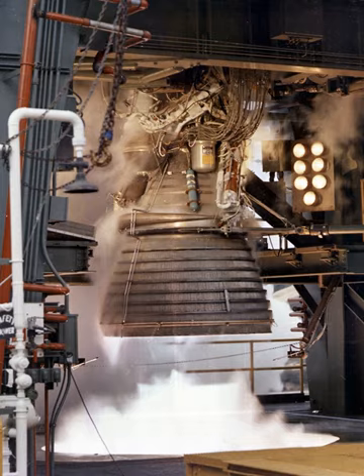The fuel turbopump, mounted on the thrust chamber, was a turbine-driven, axial flow pumping unit consisting of an inducer, a seven-stage rotor, and a stator assembly. It was a high-speed pump operating at 27,000 rpm, and was designed to increase hydrogen pressure from 210 to 8,450 kPa through high-pressure ducting at a flow rate which develops 5,800 kW (7,800 bhp).